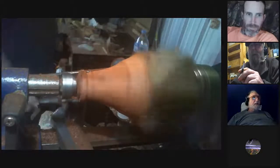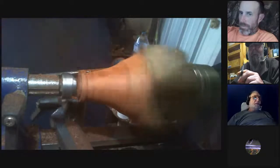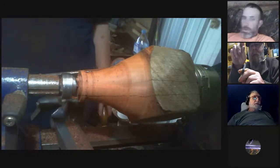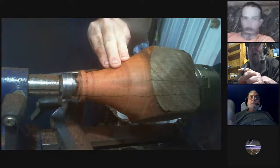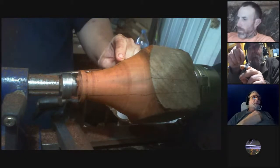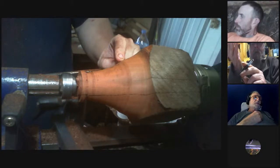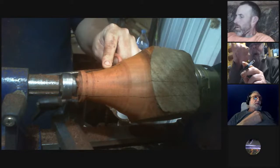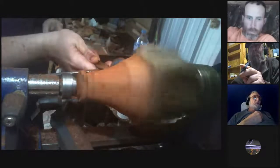No, now, that chisel should be trained, Jay. Should be trained, yeah. Right, just switch the light off for a minute. It lost its training when you drove off. Right. Put your finger on the block. See that? Right. That finger there, start your curve from there, right? So start your chisel flat on its back with the flute completely open. Roll it towards the right until you get down to, move your finger down towards the tail, so down to there, and then you start bringing it back flat again. So you take that section out.